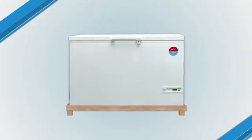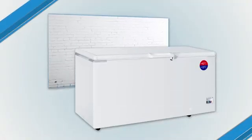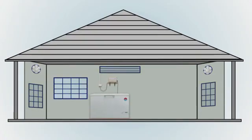Make sure that the ILR or DF is placed on a wooden stand and in a leveled state. Ensure that sufficient spacing is provided between the building wall and the equipment wall, roughly measured by a four-finger gap. There should be sufficient ventilation available in the room. There shouldn't be any sunlight falling on the equipment, and the surrounding area should be clean with no rubbish around the equipment.